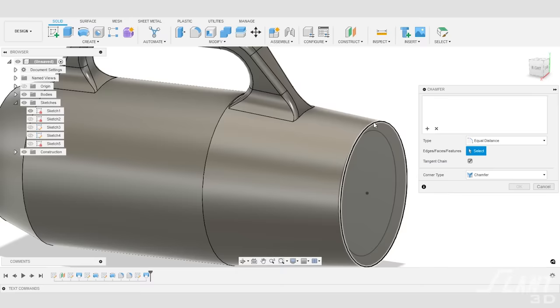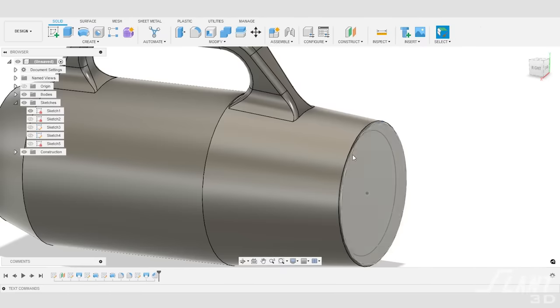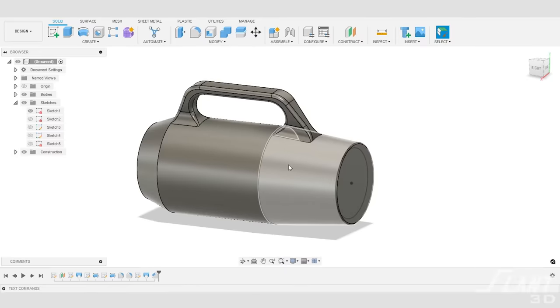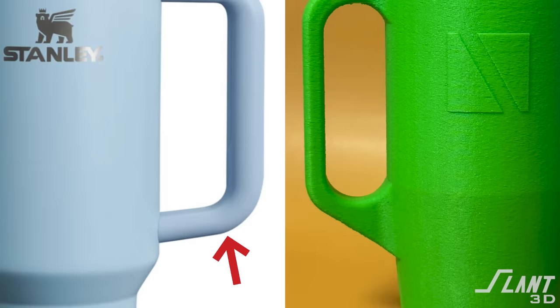The outside as a whole is actually designed to be easily ejectable from a machine, so the bottom has a good small chamfer around the outer edge and the rest of it is very monolithic and blends into itself — no overhangs or anything like that. You wouldn't want to replicate a design like a Stanley Cup, because those straight overhangs would cause support material underneath that would just look gross and create a bad quality product.